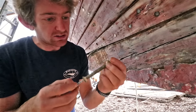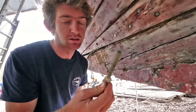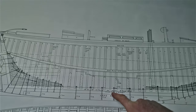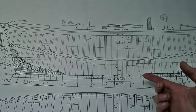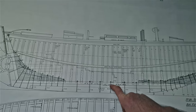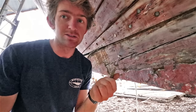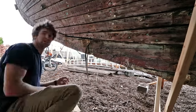A dump is essentially a nail — a blunt nail, like a rivet but with no rivet on the end. Most of the planks are riveted with copper rivets through the frames, but the garboards can't be fastened with rivets because they're blind fastenings — they just go into the keel and stop, they don't come out the other side. So on a boat of this age they use bronze dumps, which means it's going to be potentially quite hard to get this timber off because I can't knock the fastenings out. This is going to be the hardest plank to get off on the whole boat. Some may come off easily, but I suspect they won't all be as loose.